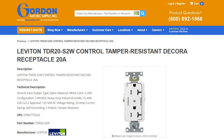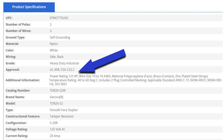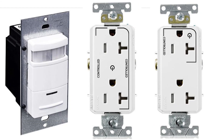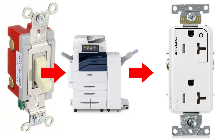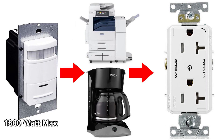I've selected here a 20 amp Leviton marked controlled receptacle. It is heavy duty and industrial grade, rated to one half horsepower. And the PIR switch that I showed is rated to 1800 watts maximum. So if you're planning to upgrade your office or your home office, be sure to buy devices that match your power needs. And remember, once I got done reading the code, the rest of it was my interpretations. So if your interpretation is different, put a comment in the comment section — you're welcome to give your opinion. We're all learning from each other here. I hope this video was helpful. Thanks.